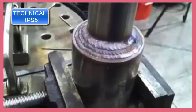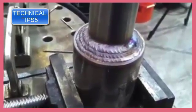And again, I'm using a 1/8 filler rod here. I used 130 amps all the way out. I'm using a 3/32, which is a 2.4 millimeter electrode, 2% thoriated. I just happened to pick up a thoriated. I generally use 2% lanthanated for everything. And I'm using 20 CFH on the argon flow meter with a number 7 gas lens cup here. And that's the final cover pass.